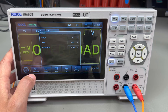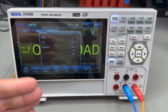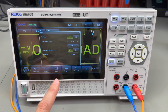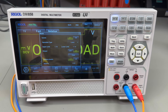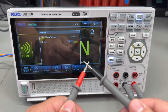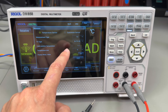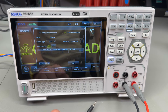By clicking the measure function you can configure things like input impedance — you can choose between 1 GΩ and 11.2 MΩ, but only while in a manual range and only if that range is up to 1 volt. There is a limit function in the math menu where you can set min and max values and it will beep when the measurement goes out of range. The continuity tester has a configurable threshold, which is useful, but it's kind of slow compared to a Fluke handheld meter. There is a universal measurement function called 'Any Sensor Measurement' supporting DC volts, DC current, frequency, 2-wire and 4-wire resistance, or temperature sensors like thermocouples, RTDs, and thermistors — quite a comprehensive suite, and you can even create a custom sensor.